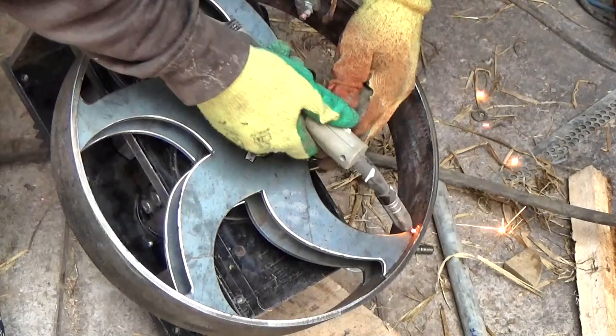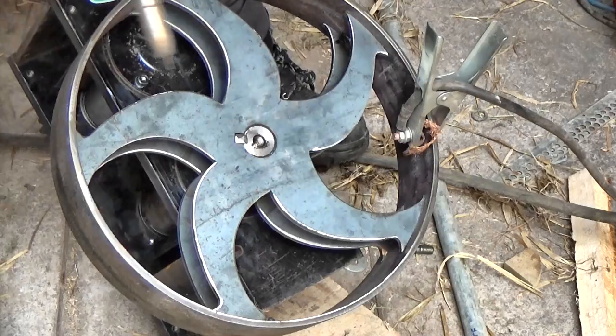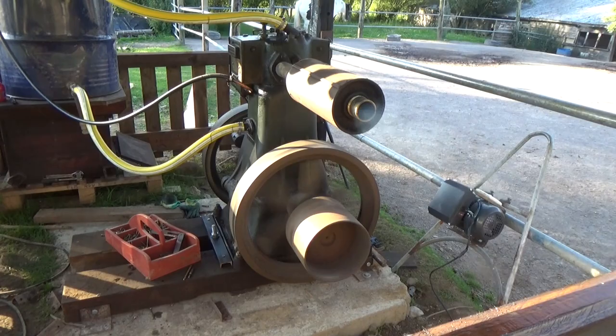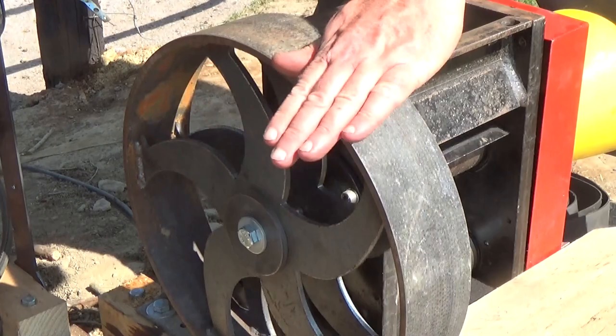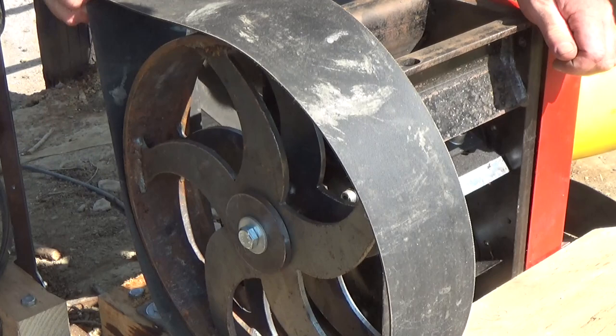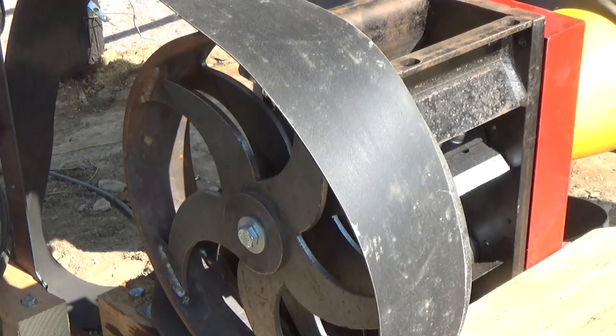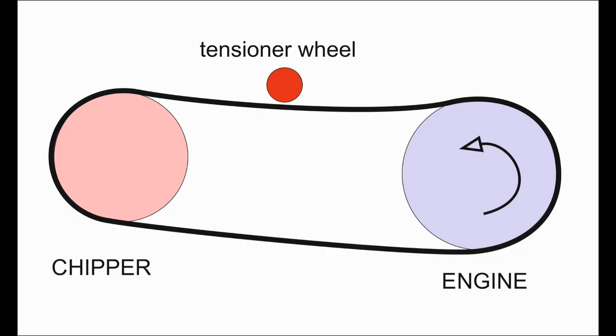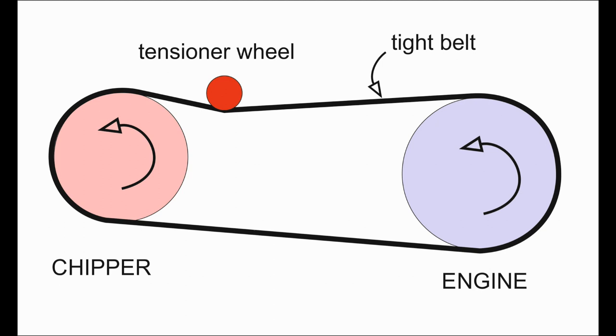Link in the description if you missed that video. My plan is to connect it to my stationary engine using a belt on this pulley. Now many of you pointed out that a flat belt will just slide off the pulleys unless at least one of them has a crown on it — that means it's higher in the middle than the outside. You are right of course, and I'm quite happy to grind a crown into this pulley if necessary, but first I want to try using a V-belt instead. I want to use a third wheel with flanges on it to keep the belt centered, and depending where it is, it will tighten or loosen the belt so it will act like a clutch too.